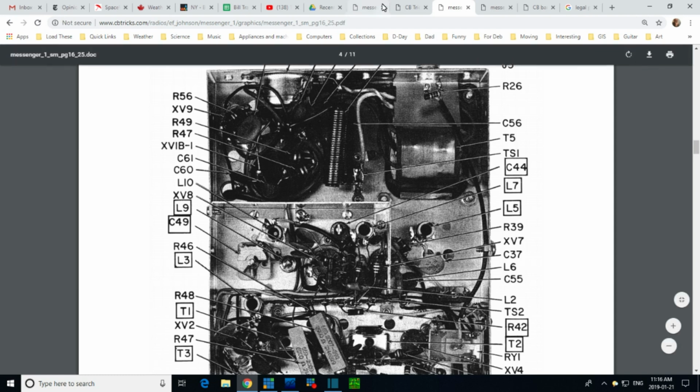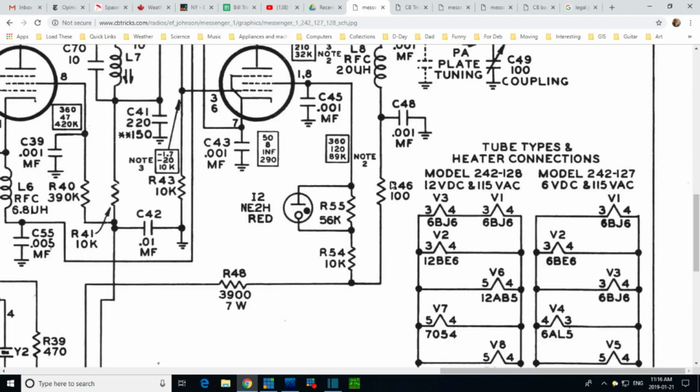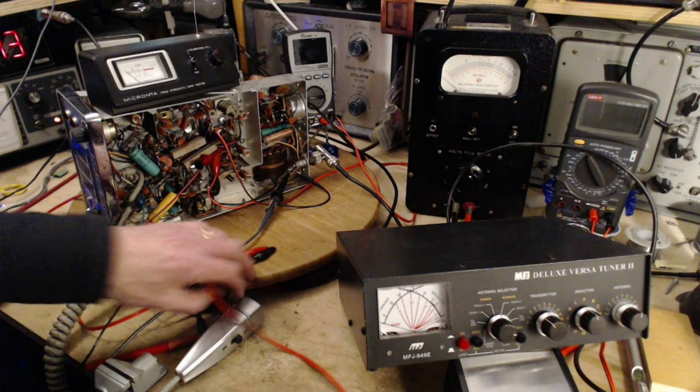So if we look again in the schematic on 46, we see the capacitor is, so current flow is this way. So positive side. Here. It's a negative sign of the meter. It doesn't matter. My meter read negative and positive anyway. Why do I even care? Come on, man. Let's get on the ball here. Okay, we'll hook up the meter. Here she is. Let's put it on DC volts.